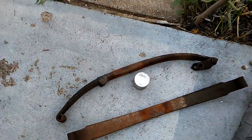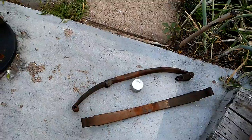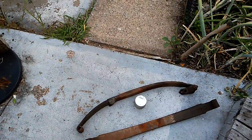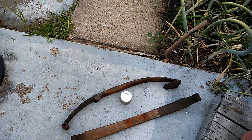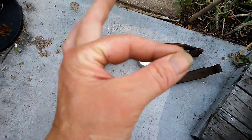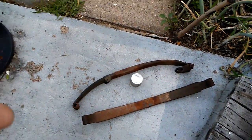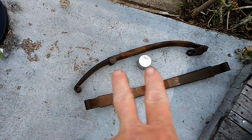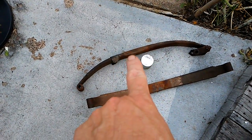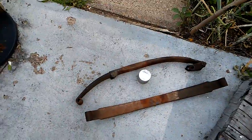I got the funny feeling there's some 5160 tool steel in there, possibly even a hot cut. If you forge it right — cut a section out, basically just a shoulder, and then draw your other end out into that standard shape to make a hot cut. Or a fuller, for that matter. You can take the rest of the metal on the tail end of it — say you cut off about yay much — and half of it would become the shank to fit the hardy hole, and the other half would become the blade.